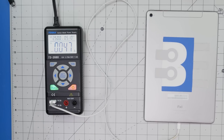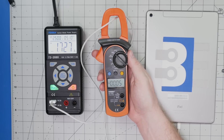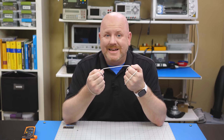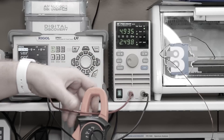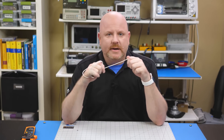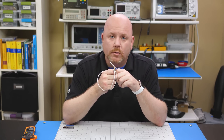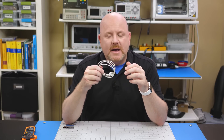Let's try another DC example with this USB cable. The supply shows the tablet is drawing over 1 amp, but the meter reads almost zero. There are two problems with measuring this cable: first, it is shielded, and second, it has both the positive and negative wires. On the electronic load, we only clamp the positive wire. Since the USB cable has both, they create magnetic fields in opposing directions which cancel each other out. I'm not going to cut up this wire, but I can show you what happens on the previous measurement if we clamp around both wires — and see, the meter reads about zero amps. So while you do not have to break the circuit to use a clamp meter, you may have to break up the cable.